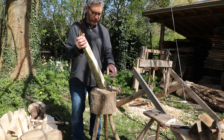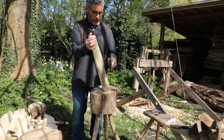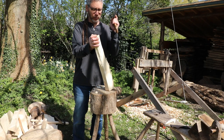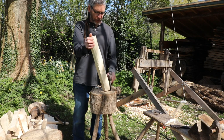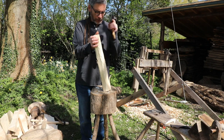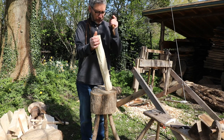That begins to get you a rough cylinder. Once you've done one half, turn it over and then you can concentrate on the second half. Feather up to about there, brush off those feathers. You don't want to go any higher than that because if your axe is above your hand you want to keep it well away from the hand holding the top of the wood. We'll take off a corner here. If you're only taking a little bit off, you can work from the top. You might take the bark off on this one — depends on what you're doing with the wood. You might want to keep the bark on for effect.